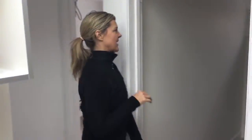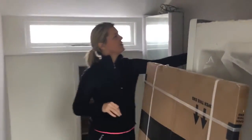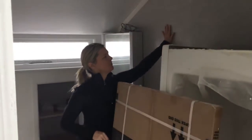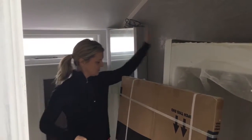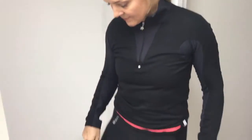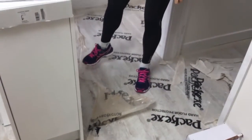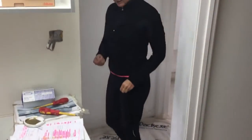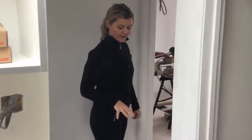We've got the bathroom cabinet in, and I haven't gone for tiles on the wall. We've gone for this new sort of splashboard, so there's no tiling in the property at all. It's this new splashboard that's really quick and easy to fix. On the floor, we've got this modular flooring, which is a click flooring. It looks like wood, but it's actually like a thick, I don't know whether it's plastic, but it looks really, really good, and it looks like wood. But it'll be harder wearing, and it won't be as noisy for the flat underneath.